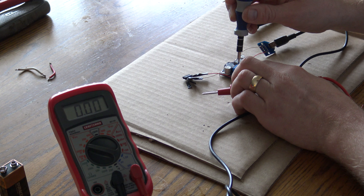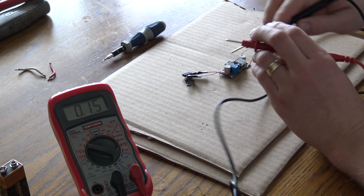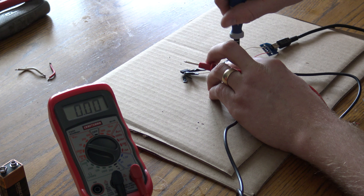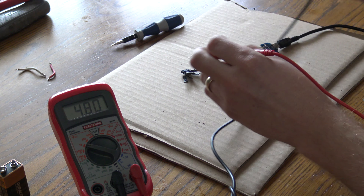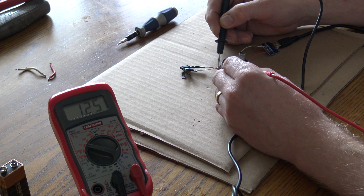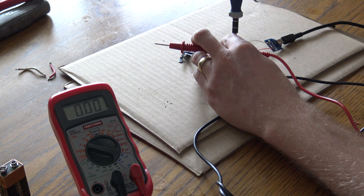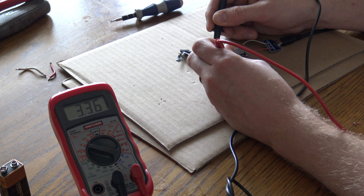Screwing it one direction went higher to 4.88, so I need to go the other way. Going the other direction slowly brings it down — 4.8 — it moves really, really slowly. Then I went too far the other way — this adjustment is sensitive. Coming back, now I'm at 3.36, getting really close. The key is you want to do this adjustment before you connect it to the Apple TV.